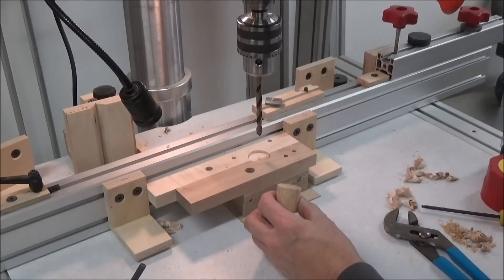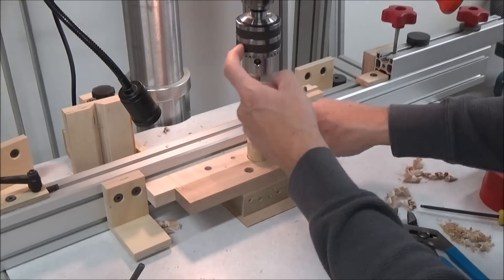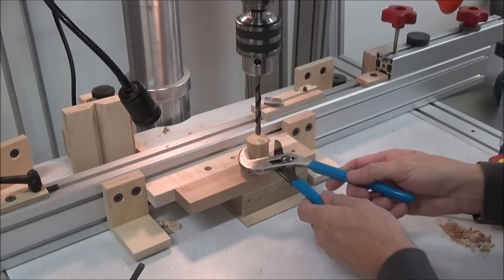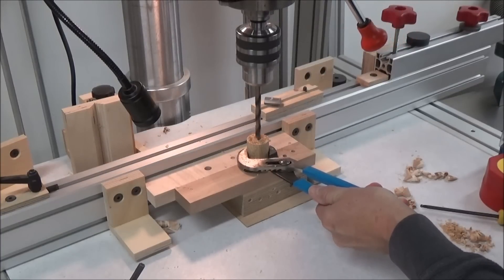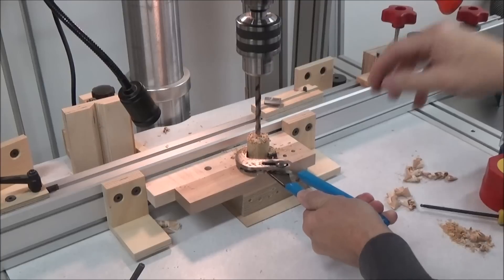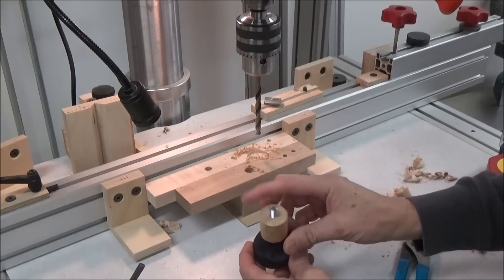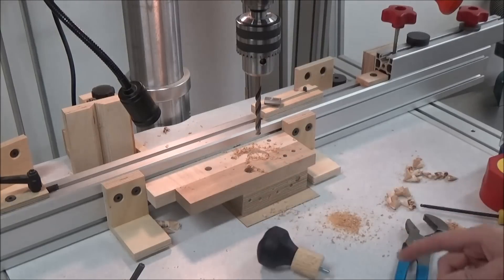The outside diameter of my dowel is about an inch and an eighth, so I drilled a little countersunk inch-and-an-eighth hole here, then changed out to a five-sixteenths bit which is about as close as I can come to eight millimeter. I'm just going to hold it with my channel lock. That'll work pretty good. I'll do that to the other ones, then we'll see how it works on the table.